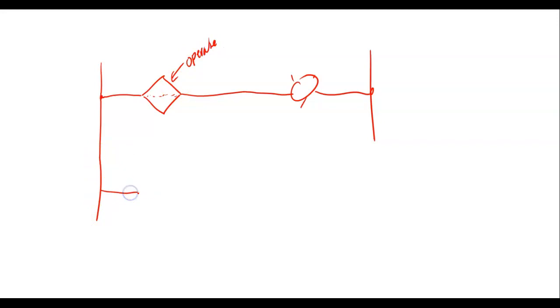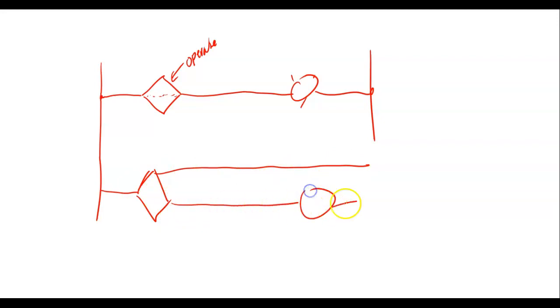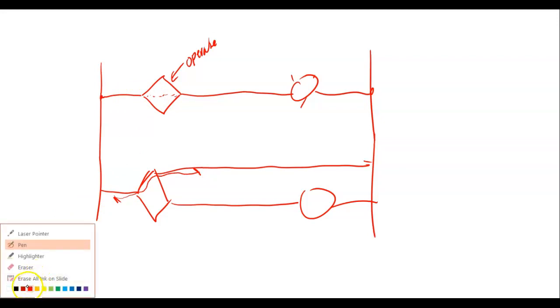Over here, this is a 3-wire sensor. The current that makes it operate is not required by the load anymore. So the current that makes it operate is here. Over here, the current that makes it operate is here. So these 2-wire sensors are going to have more leakage current through them than a 3-wire sensor, because the 3-wire sensor doesn't need current through the load. It gets current through L1 and L2 to operate.